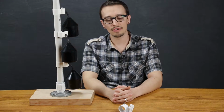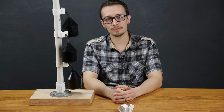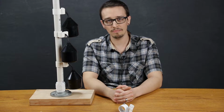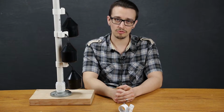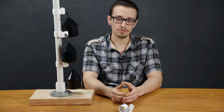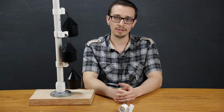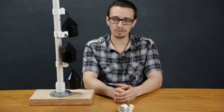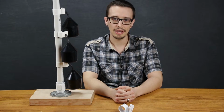Today we're going to take a look at Orenco's float collar. This float collar is for use on 1-inch Schedule 40 PVC pipe, and it provides a simple and reliable way to attach float switches. It's constructed of ABS thermoplastic, and the nice thing about it is it features some quick release clips, so there's not going to be any special tools needed to mount or adjust your floats.